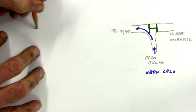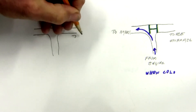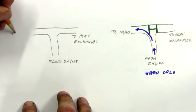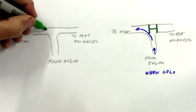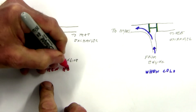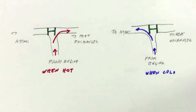Cold friction during warm-up is a major problem, and this T intersection is the universal solution. When the engine is cold, the heat exchanger and its massive cold fluid is part of that problem, so the thermostat is designed to route the warming coolant down a bypass pathway that completely excludes the heat exchanger. Fluid going down that bypass pathway goes directly to the water pump and the engine, avoiding contact with cold seawater and reducing the total mass of coolant the engine needs to warm up. Old style thermostats controlled only one side of this intersection, but this little Yanmar thermostat actively controls flow down both sides.